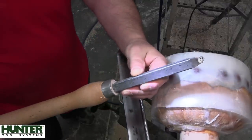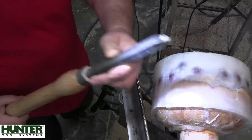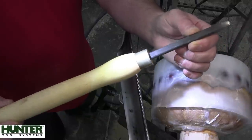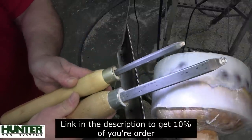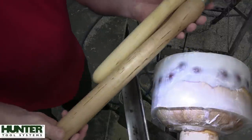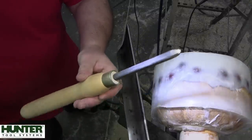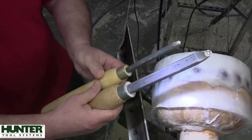I think a lot of people missed this last week. This is the number 3 or the 5/8-inch Hercules — this is the main Hercules that I use. Mike Hunter sent me this one as well. Now this is the number 1 with a 3/8-inch shaft. I like getting tools that already have the handles on them — you can get them with handles or without. I get asked quite a bit which one I like to use. Of course I want to use the bigger robust one — it has a longer handle and it's been my go-to tool for working with resin. It's nice to have the smaller one too to get into tight little areas. When it comes to woodturning tools, I do find that bigger is better.